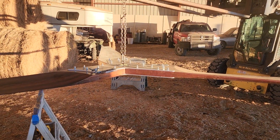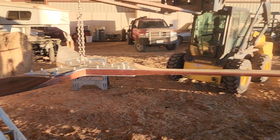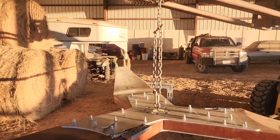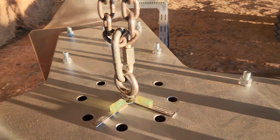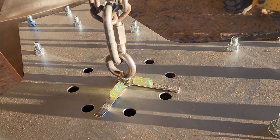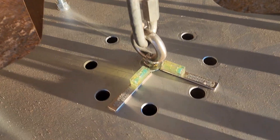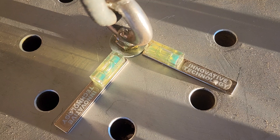Here's a short video about one way to balance blades. I've got a 22 and a half foot diameter rotor. I'm just hanging it by center from the eye bolt that's in the hub, so it's on exact center. I've got two levels at exactly 90 degrees from each other.